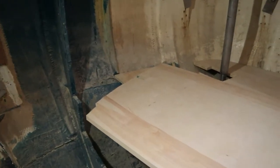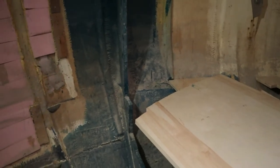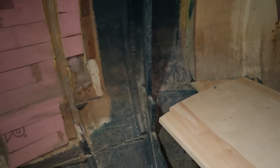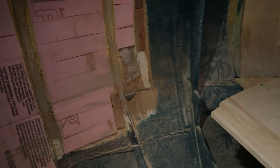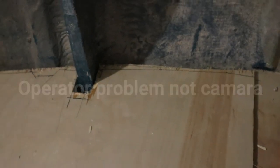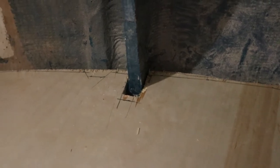So I've roughly cut the next piece of the aft berth to fit in place. The next step is to put it in place and mark it with some more specific markings so it's contoured to the hull. I've put that last sheet of plywood in place and drawn a line all the way along, about an inch from the hull. So what I'll do is take the jigsaw and cut along that line at an angle equal to the angle of the hull, and then that should fit in there quite nicely.